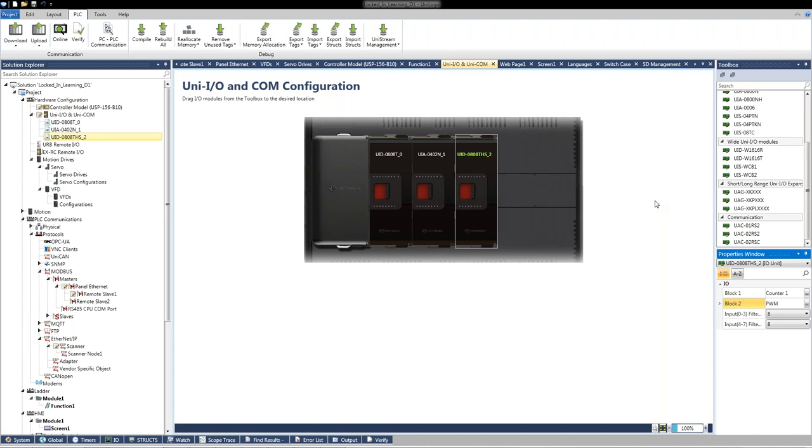With VNC, can I communicate with a UniStream device from outside my network using the internet in some other physical place? Absolutely. So if you had your panel on the other side of the world and you knew what the IP address was at that location. Anybody that pays for internet from an internet provider gets an IP address. So let's say that office on the other side of the world is 10.2.2.10. That's not what it would look like, but just for easy numbers, you would connect to that IP address and somebody at that location would have set something up called a port forwarding entry to get it to the PLC. It's the one networking step when you're trying to go outside of your network. But yes, you'd be able to bring the screen up on your phone wherever you are in the world as long as you had internet access.